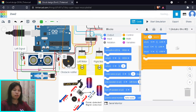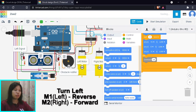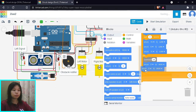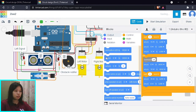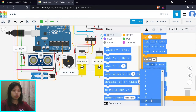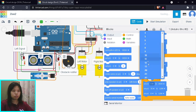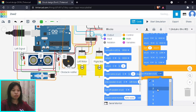In the else case, the right side is blocked and the left side is clear, so we turn left. To turn left, the right motor moves forward on pin 6, and the left motor reverses on pin 10. We activate the left LED indicator on pin 12 — switch it on, then off. Finally, we make sure the buzzer is turned off when there's no obstacle detected.